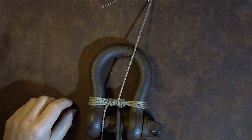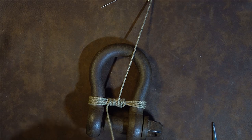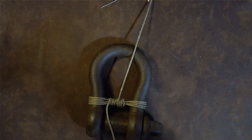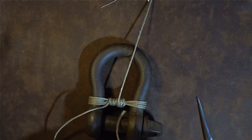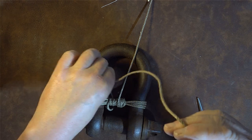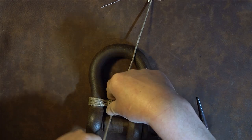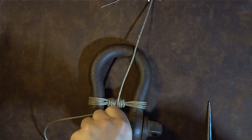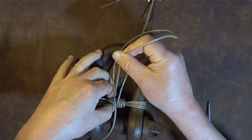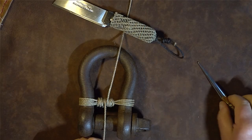With riding turns done on the right side back to the middle, do exactly the same with the bottom strand heading in from the left. Take it down underneath, pass it through, and there's the first riding turn. Pull up nice and tight, take it under again, pass the working end underneath, bring it up, keeping everything tight all the way back until the left-hand lead reaches the middle.